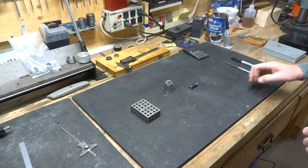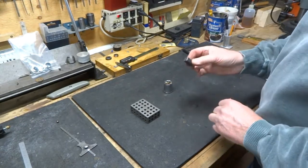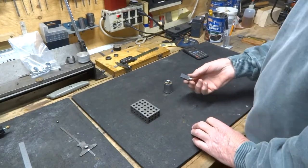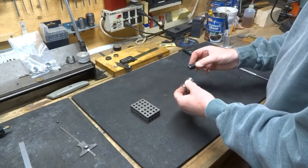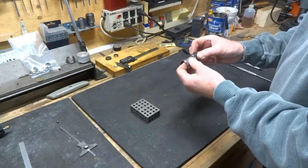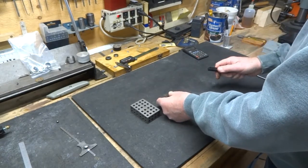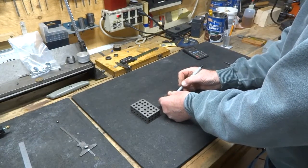Okay, I happen to have a piece of 1/2-inch key stock lying around, so we're going to do one for 1/2 inch. And it's basically the same size ball would work for the 3/8 as the 1/2 inch. So we need to know where to put that hole. So we can put this into our socket here. I can feel the other end with my finger there. That'd be full engagement for the drive right about where it is. So I'm going to mark right about there.